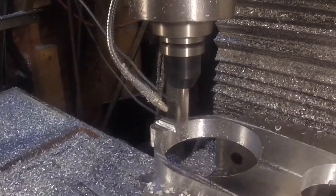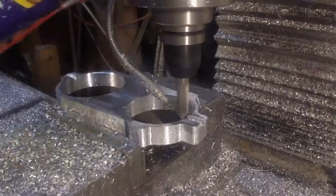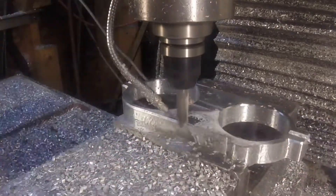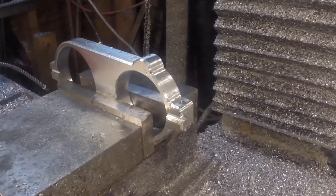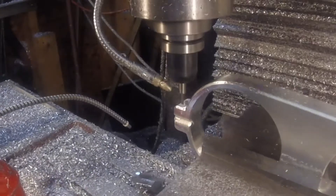I'm using a V cutter here. As you can see there are two big V grooves on either side of this part — those were an accident. They weren't supposed to be that deep; they were just supposed to be marking an area for me to cut at when I put it on the horizontal, to cut a slot there, but I guess I got carried away.